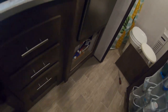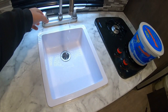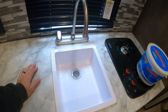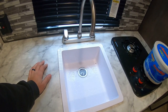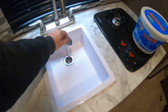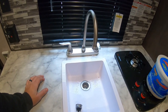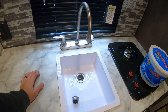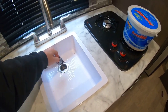The compressor's running. I'm going to hit these lines on the sink since we're right here. You can hear all the air coming out with that extra water. It's pretty clear on the hot side. We'll do the same thing on the cold — also pretty clear. We're going to run antifreeze through it in a couple minutes.